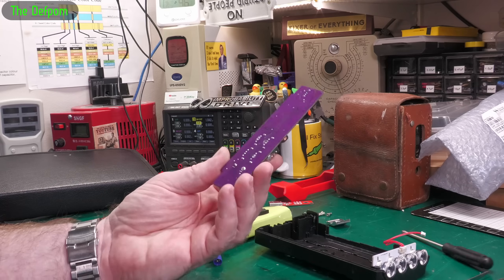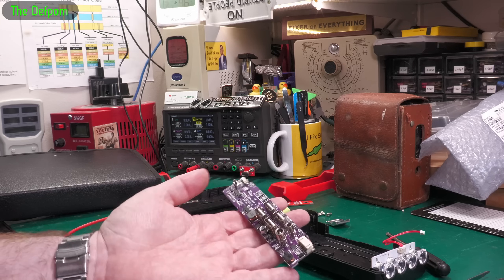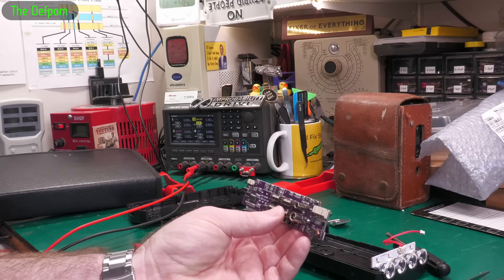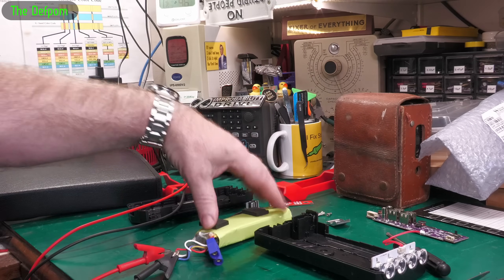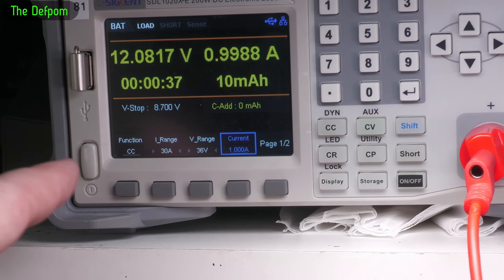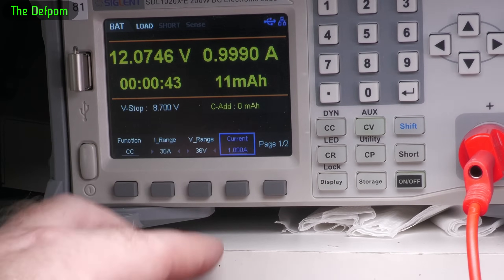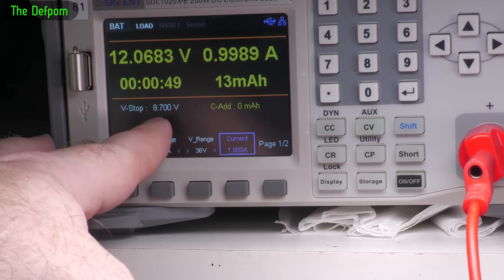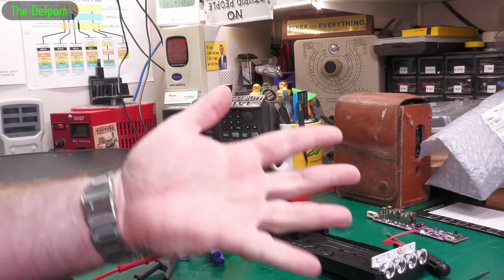Part of this is a BMS which protects the battery - which obviously works, because it didn't actually let it operate. Maybe this bit could be salvaged and put into some kind of use. I might research it and find another pack to put in it, but probably not worth it. So I've set this up on my electronic load - I'm now draining those 3 cells which are still okay. I've got it in series draining at 1 amp, set to battery mode, discharging to 8.7 volts, then it will stop. Just going to leave it running like that to flatten the battery, then I can dispose of it.